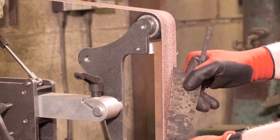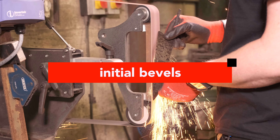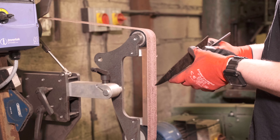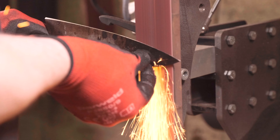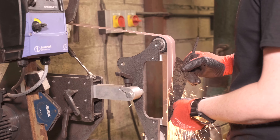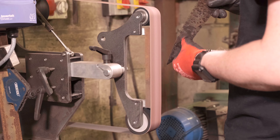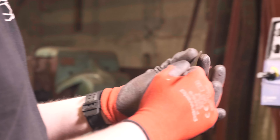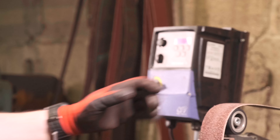Go to the belt — I'm just going to bring the edge to centre, cutting at a 45 degree angle, to bring the edge right to the middle before I start doing the bevels. I always found that just stops the abrasive from being destroyed by the sharp corner on the knife. Now pulling the edge nice to the centre and taking the sharp corners off, I switch to a new 36 grit belt.